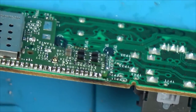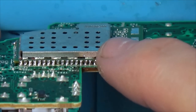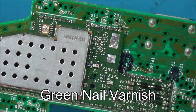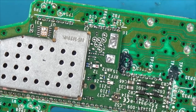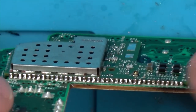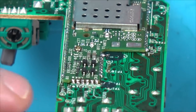Oh my, oh my, that was an epic. I found it really hard, and I'll tell you why. The board is not flat in all areas, probably because I've put solder mask under certain areas. I don't know if this one is making a connection. I might have to scrape this one away. It seemed to move a bit when I did it. So you can see now, every single one of them has solder on. I know it looks horrible, but really it's the best I can do.